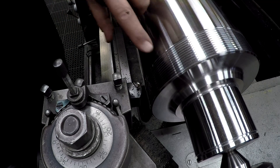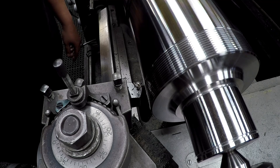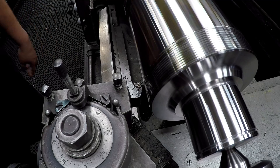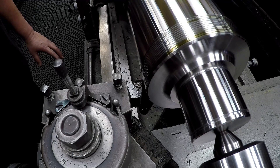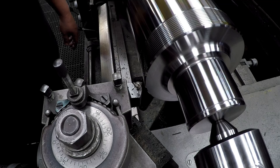This one's pretty easy to do because I'm not having to go up to a shoulder, so you can really just back out and then I hit the foot brake to stop it, and then reverse it. You can disengage the half nut but you need to stop the machine as soon as you do, reverse it, and line up on that same number again.